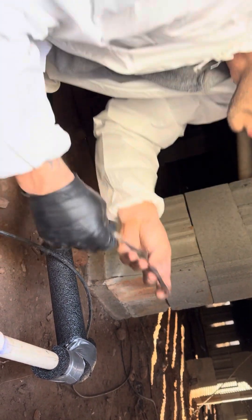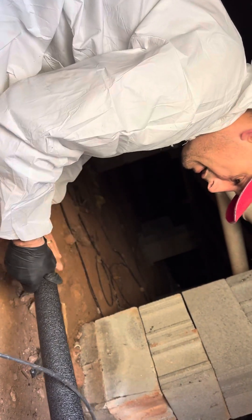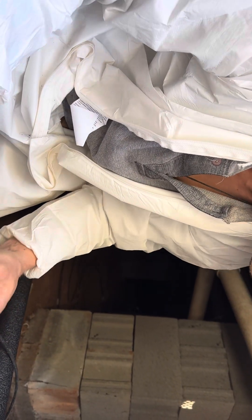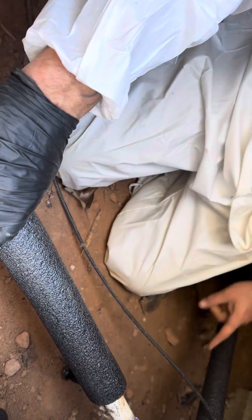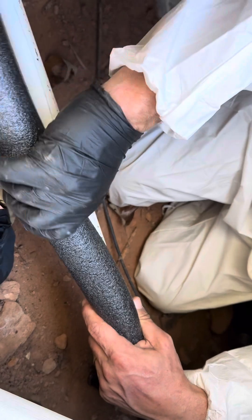Let's get a bigger piece. We pull it tight — about every 18 inches is what I usually do. You never ever want to put the slit on the bottom. You always want it facing to the side or on top, never on the bottom because of the cold air. For viewers — face it out this way, that way, or on top. I hide the gap so it faces away; nobody will see it and it's not pointing down.